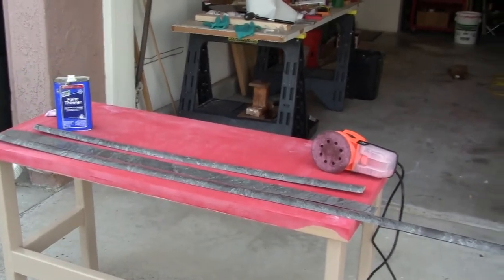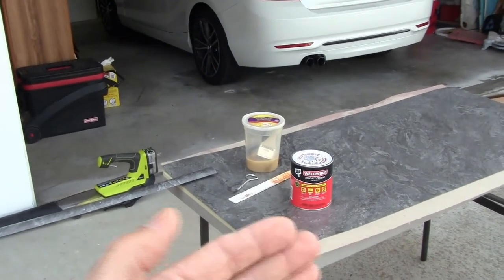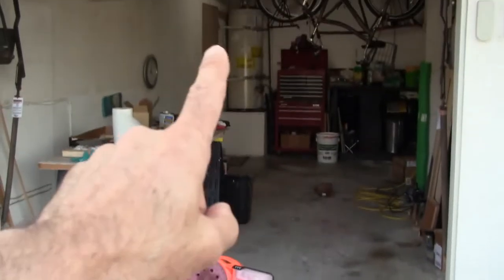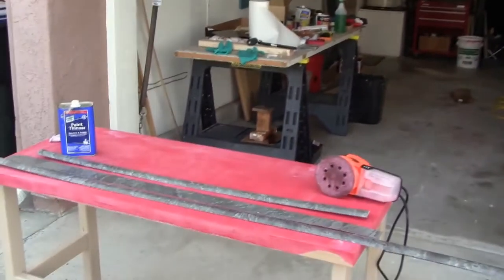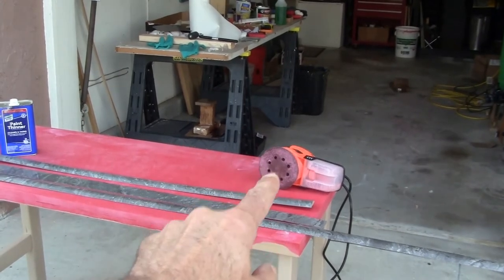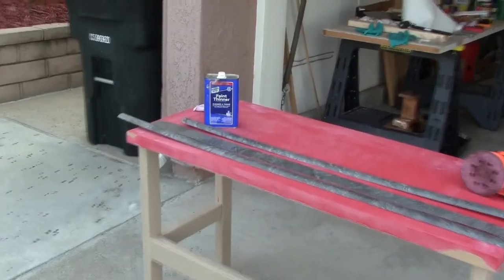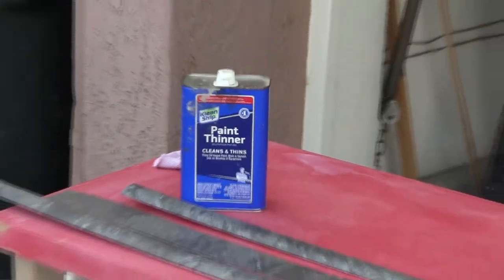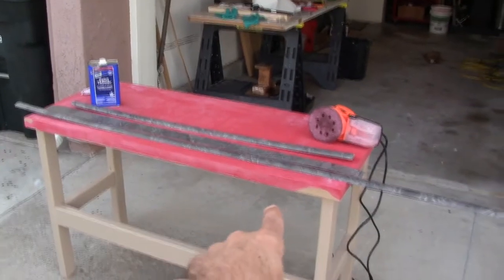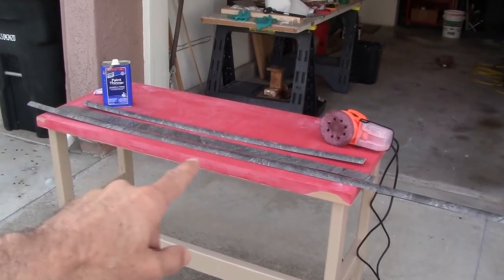That's why we want to come outside for the project, because when you use the original solvent, it's flammable. You either want to shut the natural gas off to the house — I have a natural gas water heater right there — so I want to do the project outside where I'm more well ventilated. I've already taken my orbital sander with 80 grit and sanded down the tables, and also cleaned it off with paint thinner. So the project is actually ready to go. The first piece we want to put on is this piece right here, so let's get the contact cement on right now.